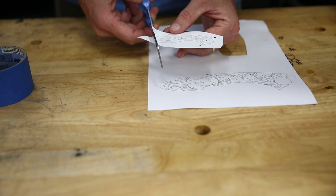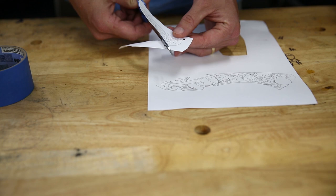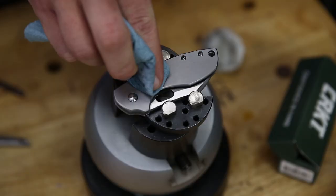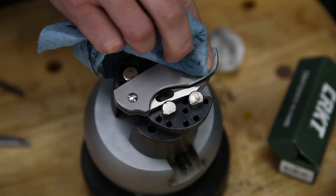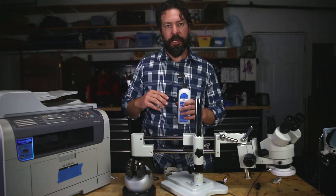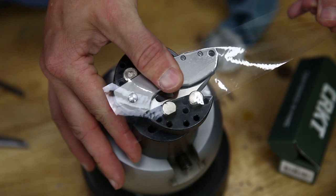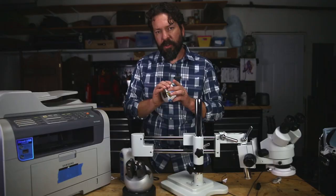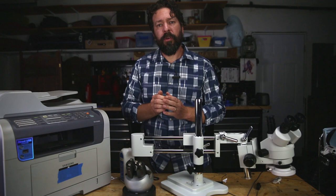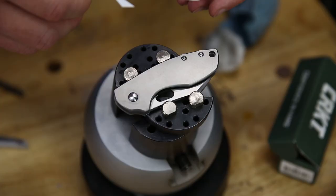After that is preparing for the transfer. To prepare, you have to cut out your design — cut it accurately, as close as possible; that helps with aligning it. I added little marks and tabs to point out sharp points, which helped me align it as well. After you've got it cut out, you need to clean your surface. Use acetone and just wipe it clean — that will get rid of any oils or materials from shipping, the manufacturer, or handling. Then this step really improved my transfers: I take clear packing tape, lay it on there, smooth it on, and peel it off a couple of times. That pulls off any oils, and I suspect it also leaves the tiniest bit of glue residue on the surface that helps the toner adhere. I'm not entirely sure if that's what happens, but it works and it makes transfers better — so I do it.